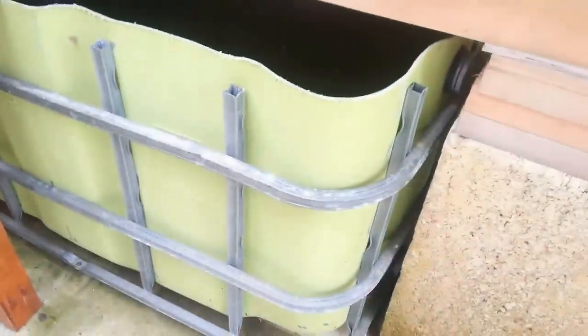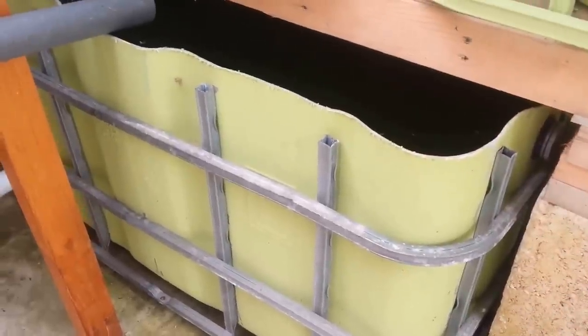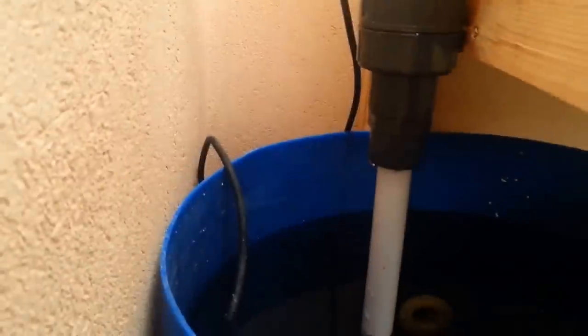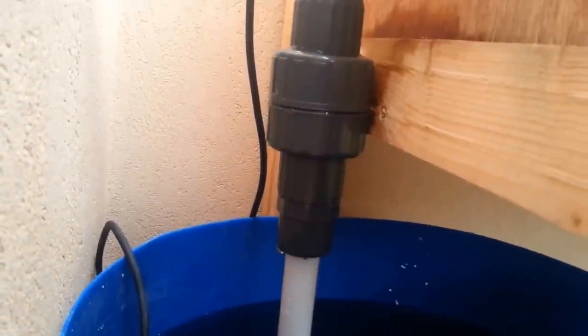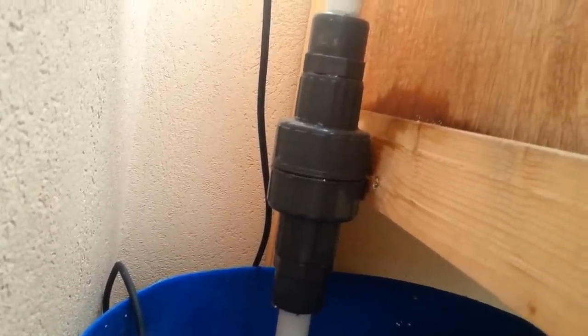There's the outlet for bed one — and that's our sump tank, which is 575 liters, about 500 liters when full to the top. We had our pump in the sump tank originally, but because we moved the floating raft bed closer it was difficult to do maintenance, so we ran a secondary line into a 100-liter barrel and run a 4,000-liter-per-hour pump from there. There's a one-way check valve so that in any power outage I'm not affected by drainage overflowing the sump tank and causing a mess.